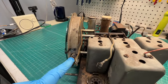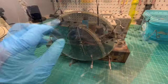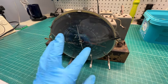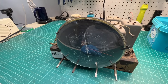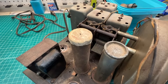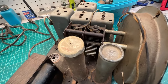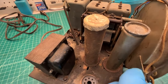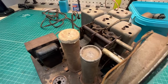Up next I'm going to remove the dial lamps and see if I can get this glass off including the fasteners that hold it in place, get the dial pointer removed, and go ahead and remove the tuning condenser. As you can see, the tuning condenser is rocking back and forth freely — I'm sure the mounting grommets have just deteriorated over time, which is not uncommon. I'll get those replaced.